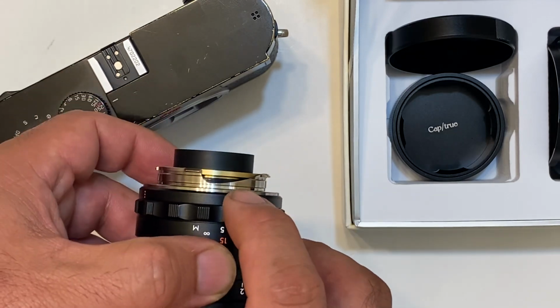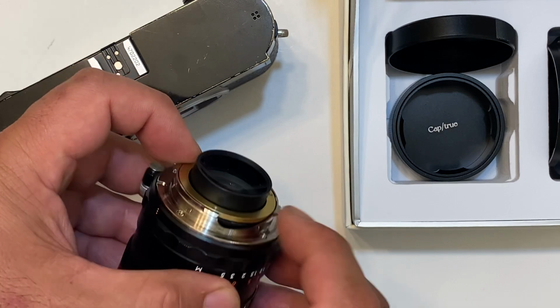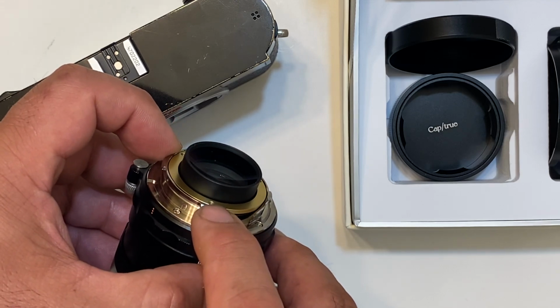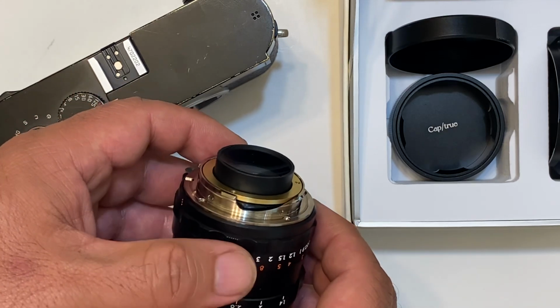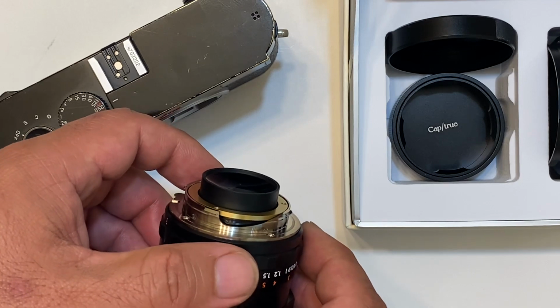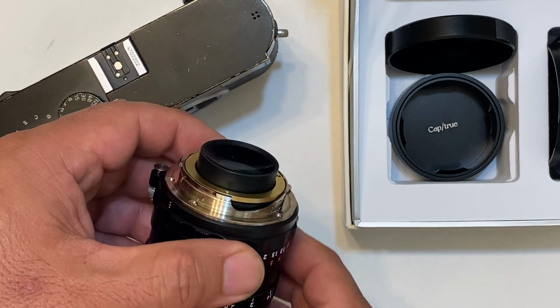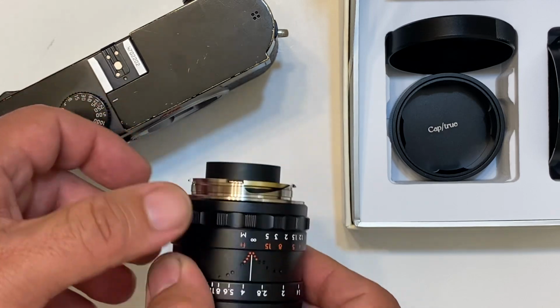Okay. The other thing I learned last night is, at first I tried to lock down these three screws, right? By the way, they were not Phillips screws nor flathead. These were Torx screws. So tiny little Torx screws. At least my Torx bit worked really well. My Allen key didn't. Okay, so I think these are Torx screws. It could be Allen, I just didn't have the right size for it. Anyways, playing with these three screws, you may have to move the ring a little bit to the left or the right, but in combination of those, it should get your rangefinder calibrated.